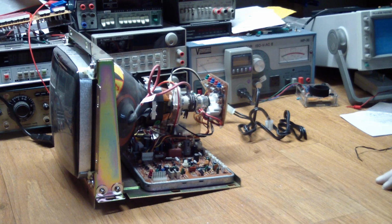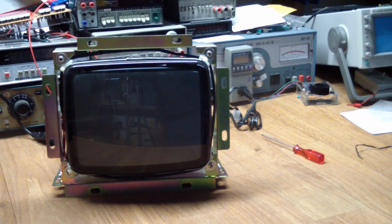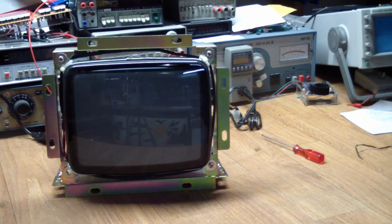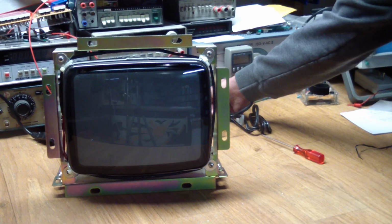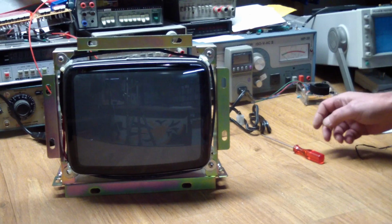I'm going to give it a few minutes at each 10 volt interval, and once we hit 120, I'll bring you back. Nothing special happened. About half an hour passed. I kept the camera rolling, but it was boring even at high speed, so we'll just quickly go and turn up the variac now that the capacitor is half formed, supposedly.